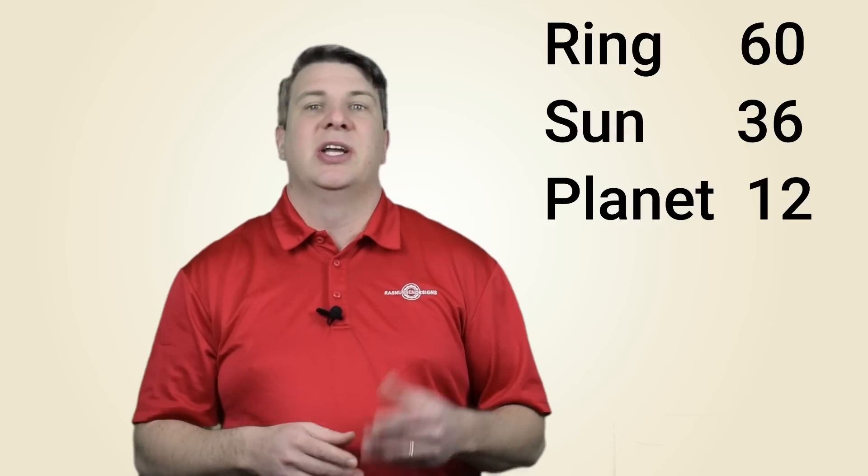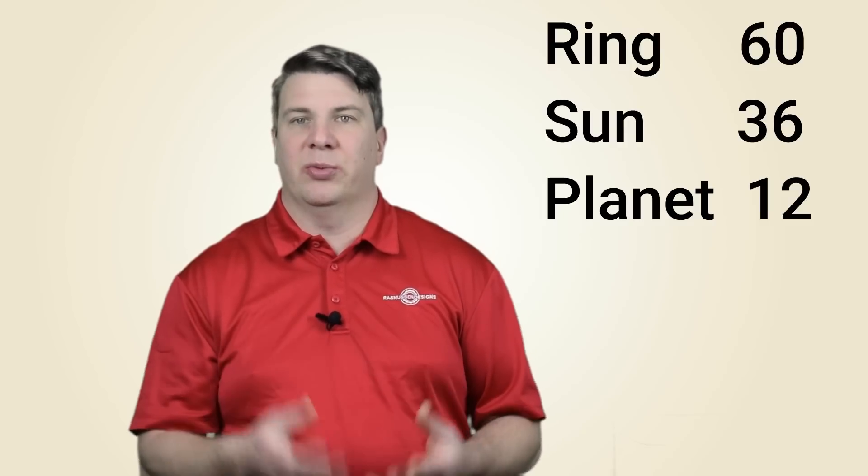On the second stage we have 30 teeth on the sun gear, 18 teeth on the planet, and 66 teeth on the ring gear. In all these cases we had to keep the same physical distance between the center of the sun and the radius of the carriage the same, so we could mount all of the planets on one single straight pin. If the planet size was varying differently, you'd have step pins, which would be very difficult to design, manufacture, and assemble.